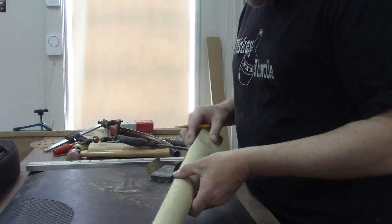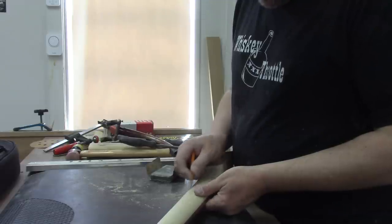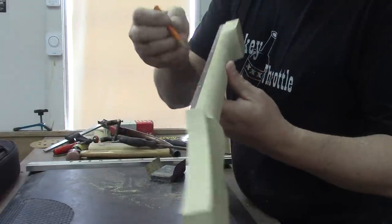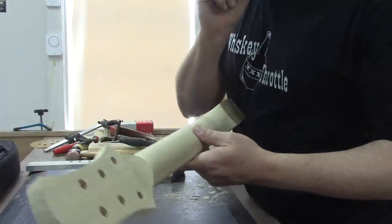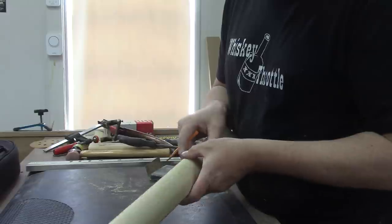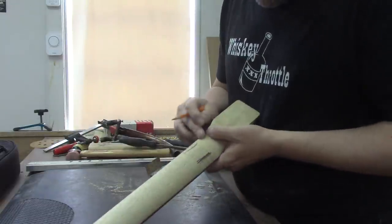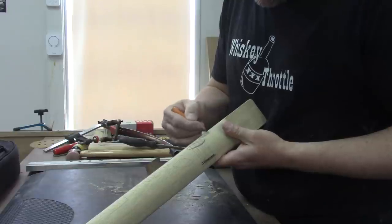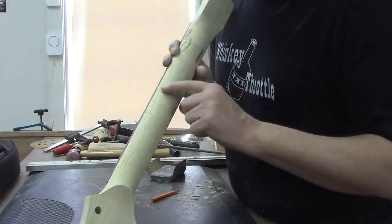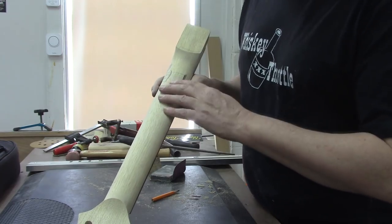All right, so I got most of the hand sanding done, and I'm noticing there's a patch here that doesn't feel right, and a patch right around in this neighborhood that kind of needs to be rounded over a little bit. I broke the edge off of the fretboard, but the camera wasn't turned on — so let's go back and I'll walk you through some more of that stuff. We'll try to hit this patch here. This other side looks pretty decent, but right here I'm having an issue. I've got my neck all marked up and we're going to basically take these marks off on the deadhead sander. You'll see how surgical of a tool it can be, and then we should be solid.